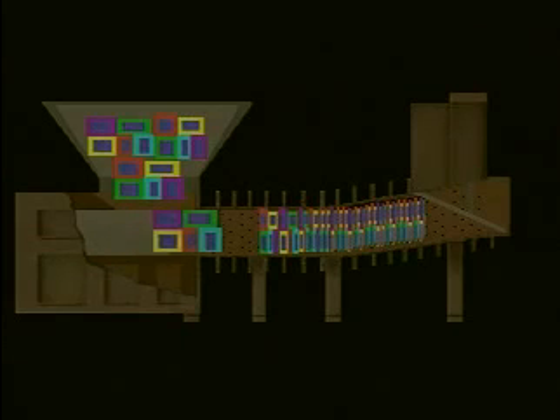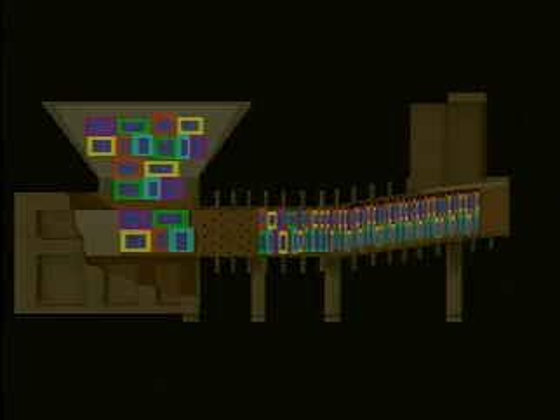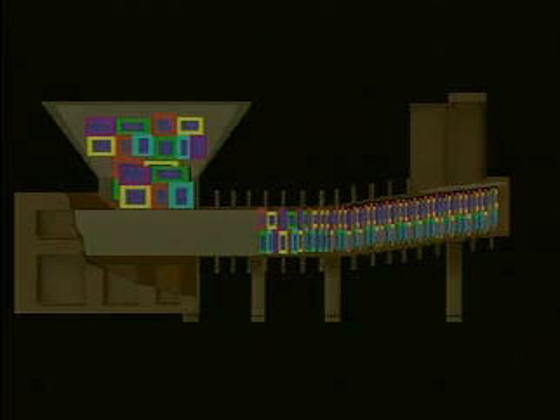The RAM then cycles forward, compressing the material. Program steps of increasing pressure, combined with pauses as each force level is reached, ensure that the optimum amount of liquid is removed from the innermost section of the mass. Repeated cycles continue to remove liquid, and a very dense log is formed in the extrusion area. The patented computer program allows for more and more liquid to be removed as the log moves through the extruding area and exits the extruder into a container.